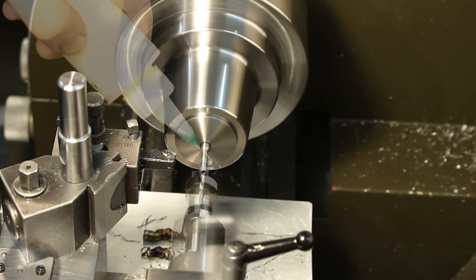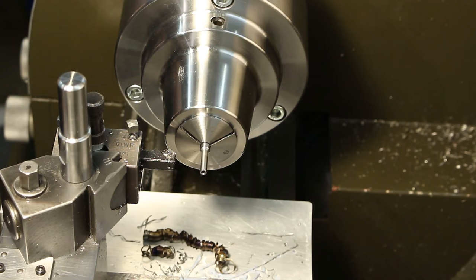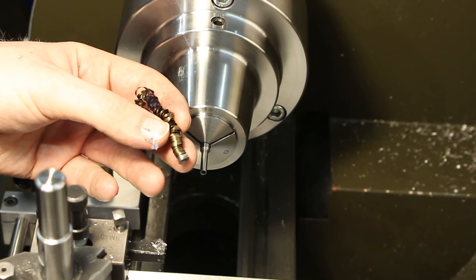Okay, drilling the 2.6 millimeter hole, 26 millimeters deep, that's 10 times diameter. And by the way, look at the nice chips the reground carbide inserts peel off in drill rod.